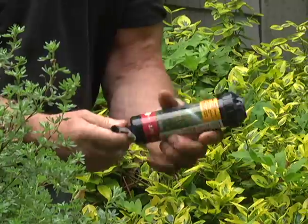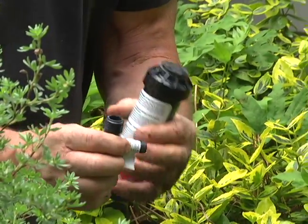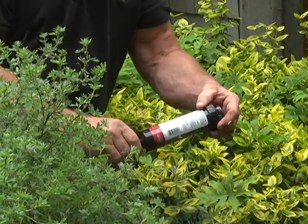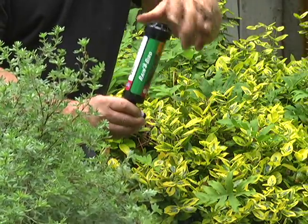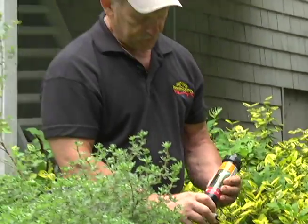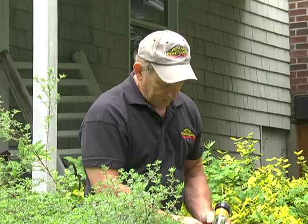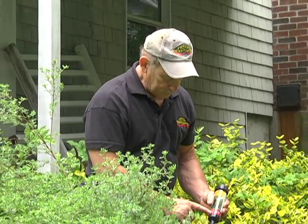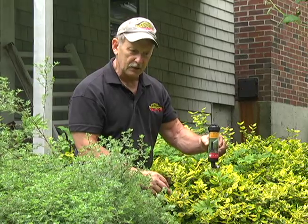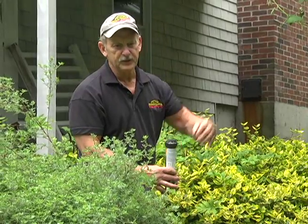What you're doing is turning it on the threaded little elbow that's there — that's where our hose connects. You've got plenty of thread, and if you don't have to turn it too much, which we didn't, that's the easiest way — just turn the whole sprinkler head a little bit. When you go to buy these, the label shows the spray pattern. On this particular one: 40 degrees to 360 degrees, so it almost has a complete circle. It'll go from 19 feet to 32 feet out — that's the circumference of the water spray, so this head covers a large area.